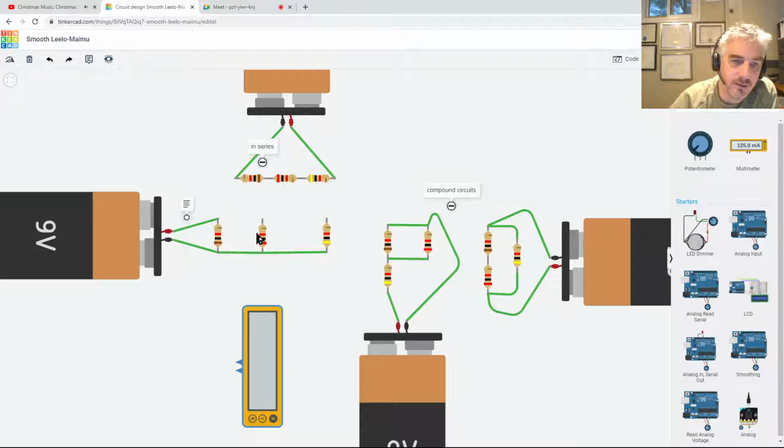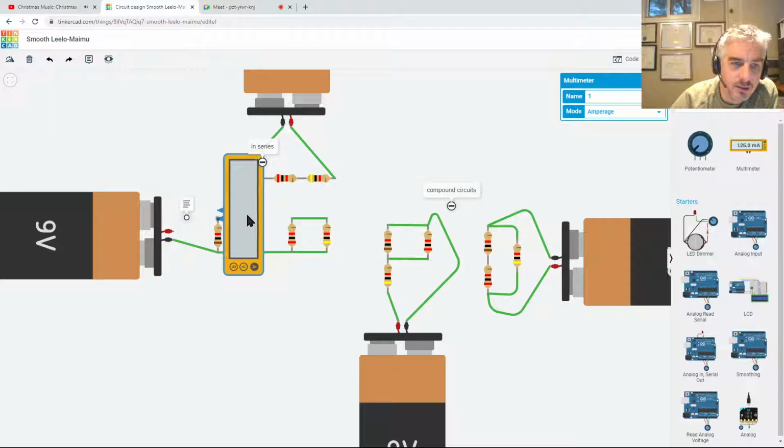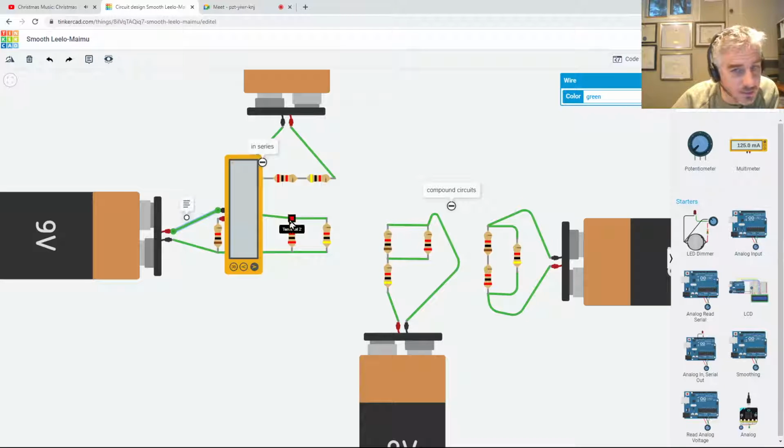Right, so we'll bring it here. Let's slide that guy here. Let's get rid of that wire. Connect, connect, connect, connect here, and then connect here. So now my current going through R1 is getting interrupted, but the rest of the circuit is working as it used to be. Okay, so I should read another reading, which makes sense.